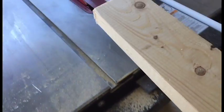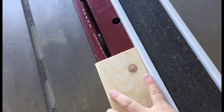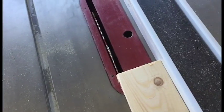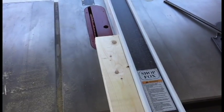Okay, what I'm going to do now is I'm going to run these through my table saw because 2x4's actually have a little bevel on them and I don't want that, so I'm going to clean them up, run them straight through and it'll get nice and square on all the sides.